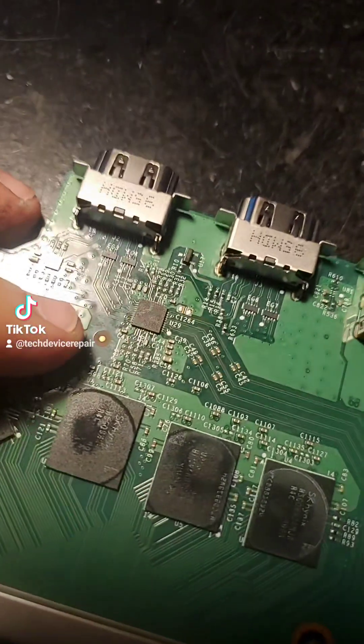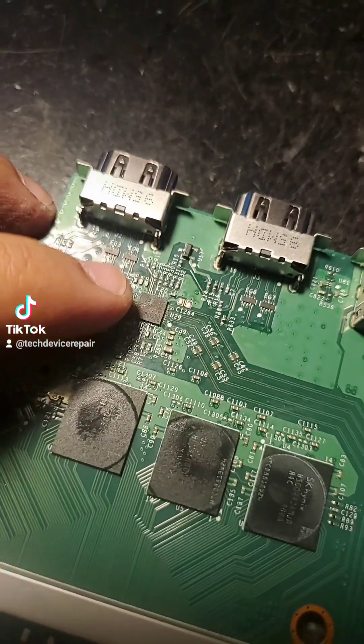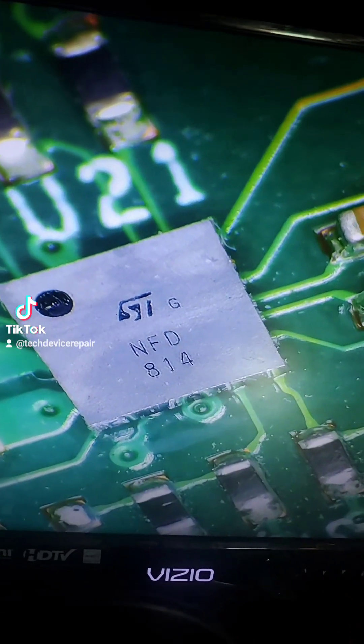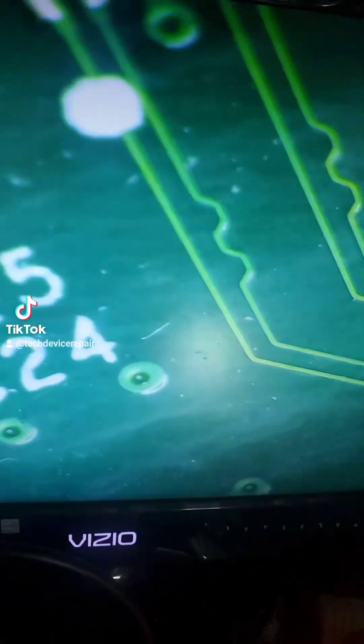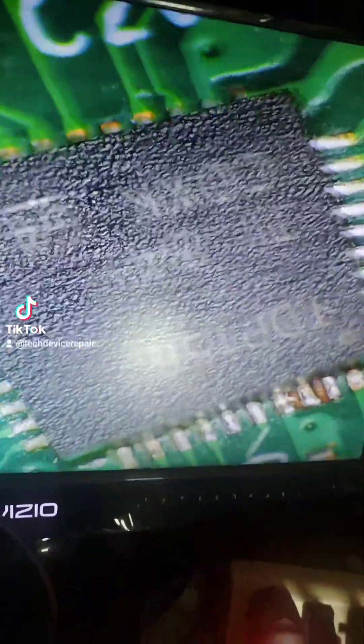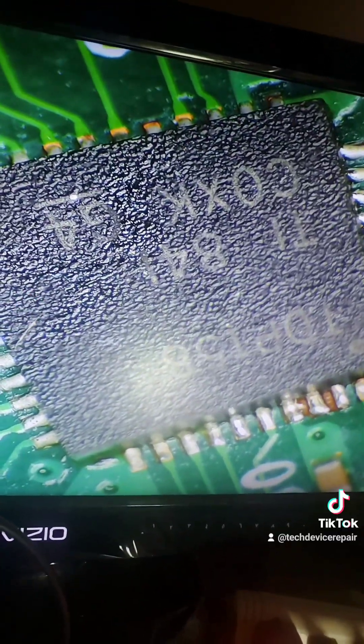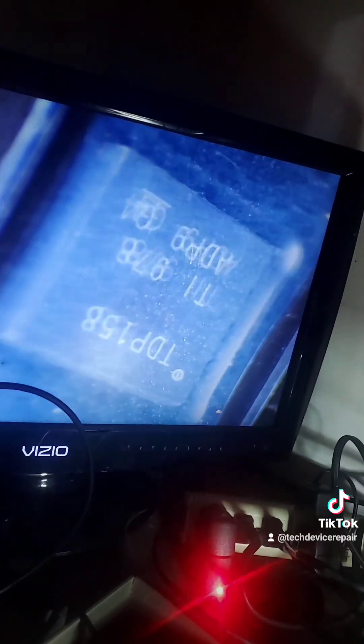The area of concern is right here, with that chip being the culprit most likely. Under the microscope, this is the ESD chip — that is the second to go in the line. However, our concern is with this TDP 158 chip, so let's remove this one first and test. I have these chips directly on a reel.